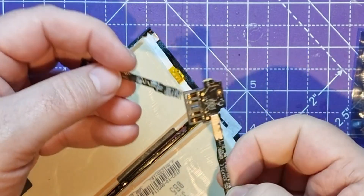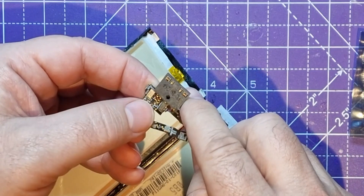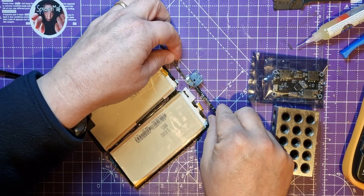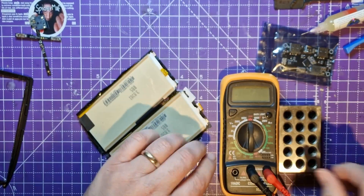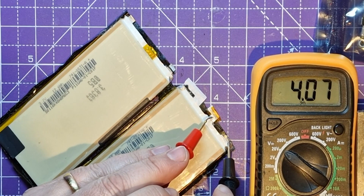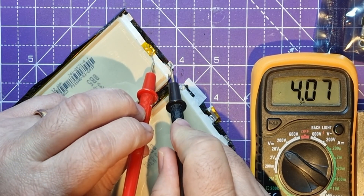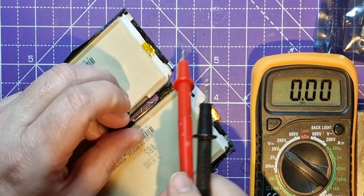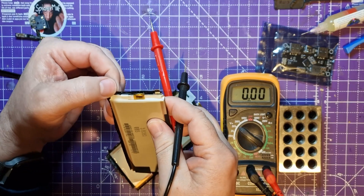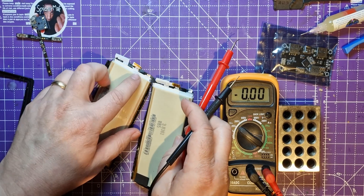It has a flash chip look to it, but there wasn't a processor underneath there. Yeah, I don't think that's a microprocessor. There's a teeny little device there and some kind of crystal. Anyway, I've disconnected those. The center terminal is positive — I've got 4.7 volts there and this one got four volts. So I think this was connected across to the other positive terminal, so I think these were just ganged up together in parallel.